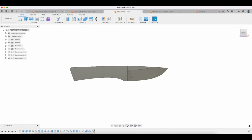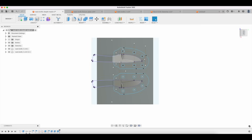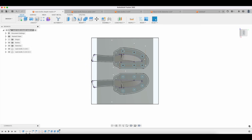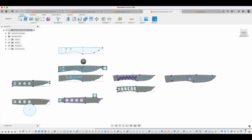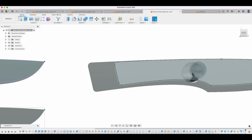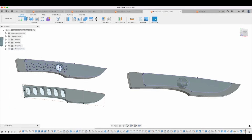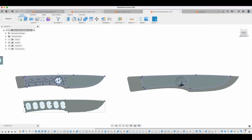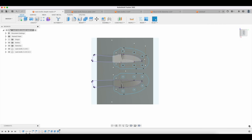Part of the fun of it for me is to say, okay, I got 85% of the way there on this particular design, but I've hung up on something at this stage. The sheath's detent feature is just not working as well as it might. So let's go back to this stage and see if, as we're auditioning different approaches to this knife, maybe something else works. That's the purpose of this little feature right here. There's sort of a dimple in this particular design that I came up with that was going to give the Kydex a little bit, oops, where's the Kydex? Over here. It would be right here, and that dimple would give the Kydex a little more something to grab onto.